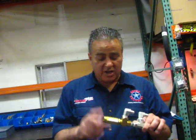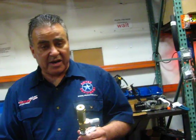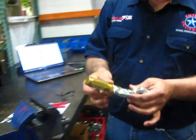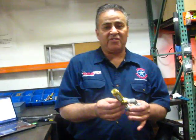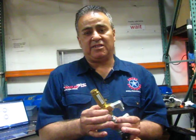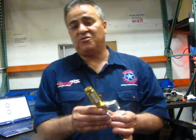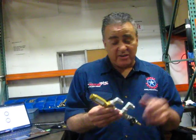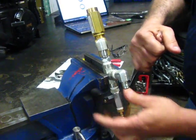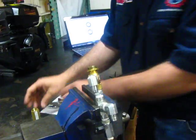We're going to show you what area causes it once we get into the valve itself. If you ever want to use a table vise to remove the fittings off of this, never put the valve itself into the vise, because the valve is brass and the interior is a very fine machined cylinder. By grabbing it with the vise, there's a possibility that you might make that perfect cylinder into an oval shape, and in that moment the regulator is going to be gone — it will not be reusable. Instead, use the fittings to hold it in the vise to remove the cap and spring.